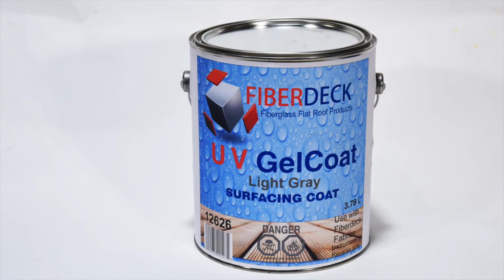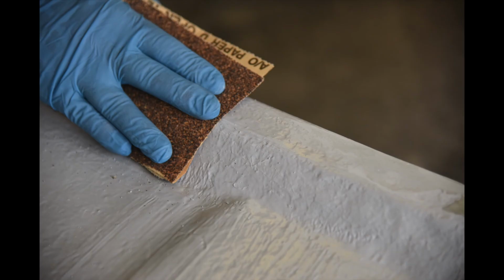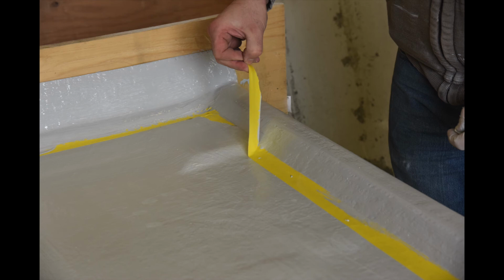The second coat of Rayplex gel coat has air dry additive or wax solution added, plus a fine sprinkling of fine sand for that non-skid surface. The second coat is divided into 2 steps. Step 1, sand the area again looking for any roughness. Tape off the area that's not going to be sand coated. Gel coat the taped off area and allow it to dry. Remove the tape as soon as you've finished.